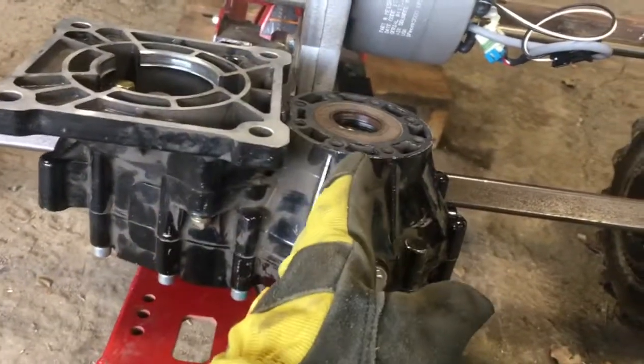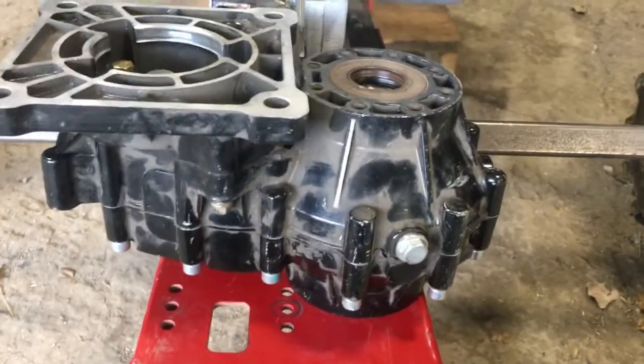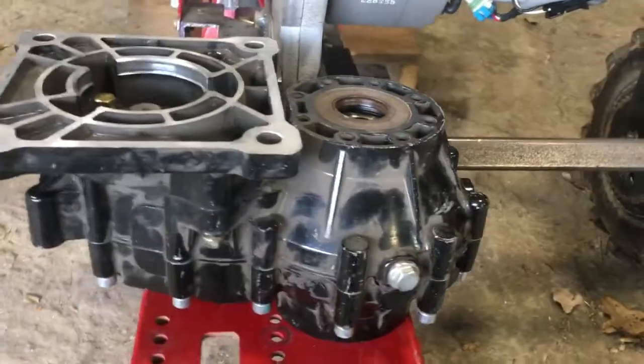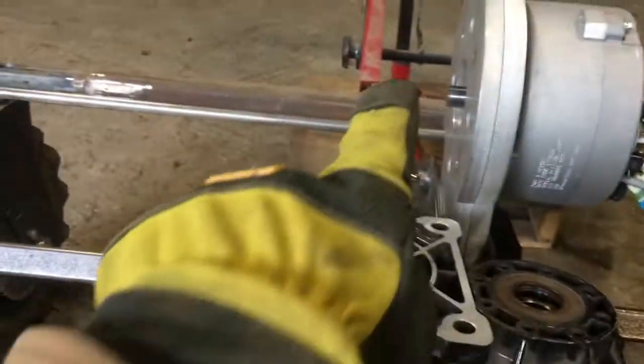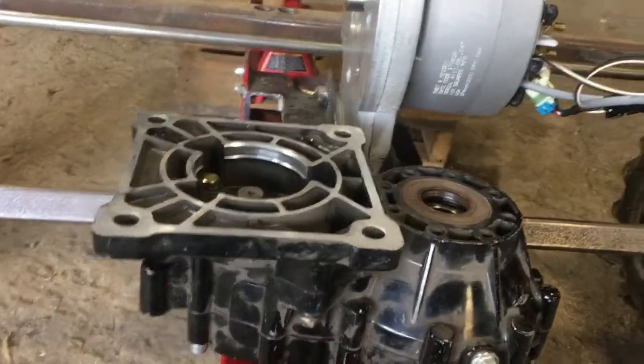This will provide the step down in speed. I think this one is geared eight to one, but you can order them more or less as you need. It's got a couple little stub axles that come out of the differential, and in this case they will run half shafts out to chain reduction final drives at each wheel.